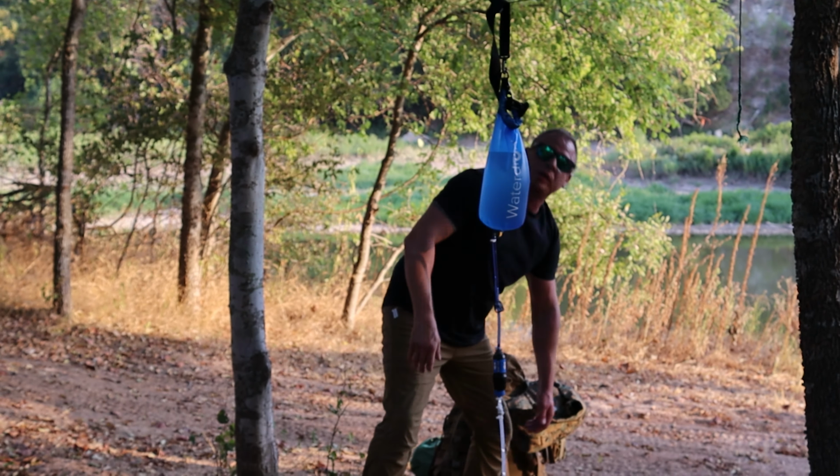Don't forget to put the actual filter onto your setup, or this may happen to you. This is the WaterDrop gravity bag quick disconnect end, hooked to a 1/4 inch hose clamp. The blue hose comes with the WaterDrop. It's a 1/2 inch by 3/8. The black piece is an adjustable speed hose clamp. You just press down on it to put pressure, and then you press the end of it and it'll release it. It's going to run to an inline adapter.